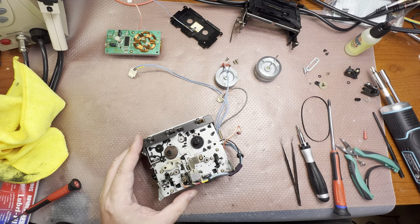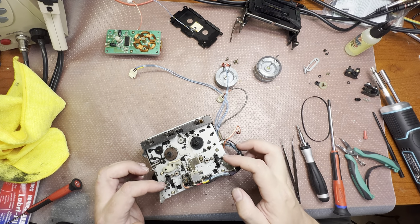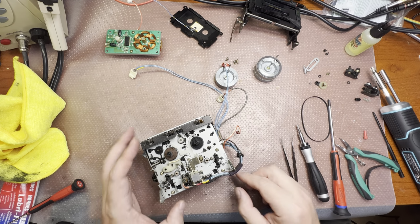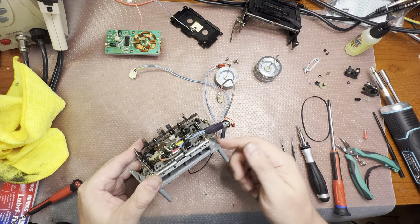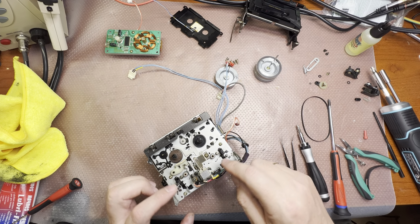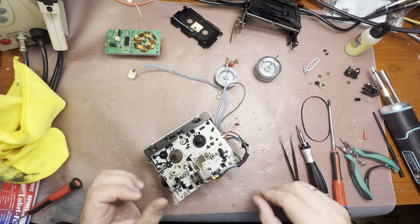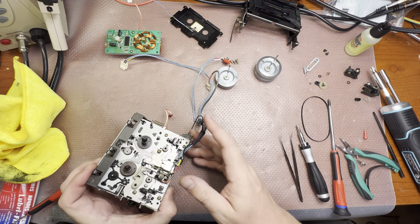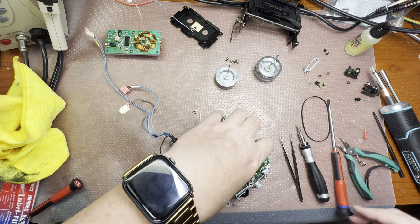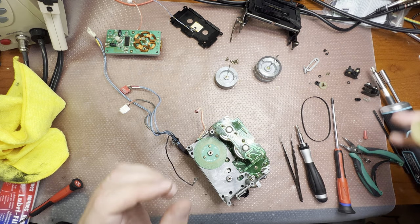If they did it differently and these shafts were installed somehow differently, maybe it may work better, but the idea was to have a good base where these shafts are parallel to the capstan bearings. That's very important. That's where we're getting good results from the Sony deck. Okay, next piece, capstans.